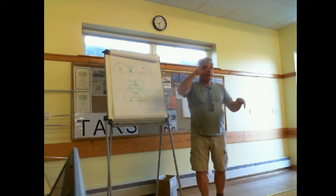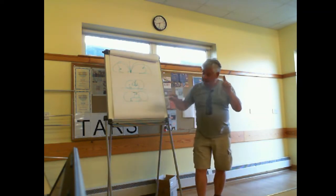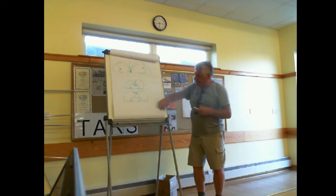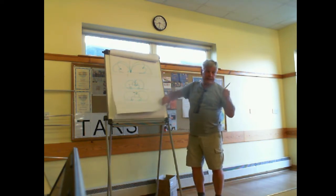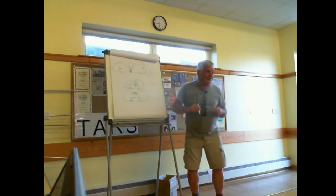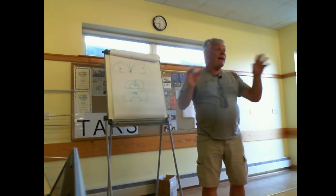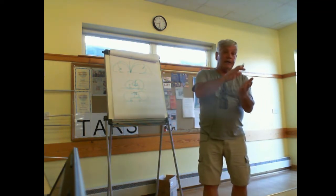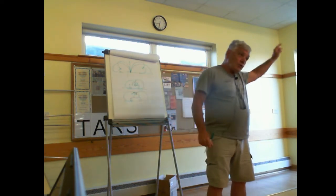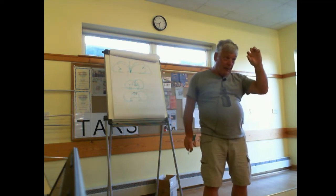All of these things in design are very important. Now I've bent it like that. So we all understand that. We can actually bend that all the way down there, and it is still a vertical. I have made antennas that are literally flat, square plates that go on top of motor vehicles. They are nothing more than that high.